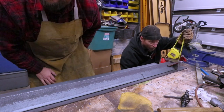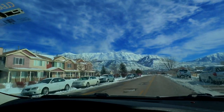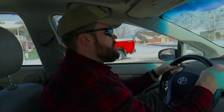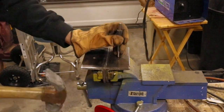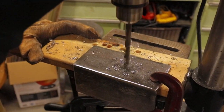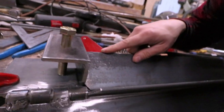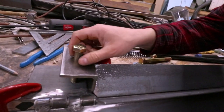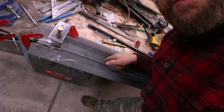Try to measure twice or more and cut once. We need bolts, we need nuts, we need metal, so we're going to the store. We're cutting these holes a little wider so that when we put our bolt down through to seal off our metal when we bend up, it gives us a little wiggle room to allow for say a thickness of sheet metal. When we bend and it won't work - us going why can't we bend this with all our might - that's because it's so tight. We're going to allow for a little wiggle room. Thanks to all those who made those other YouTube videos that helped us on this.